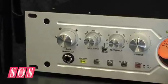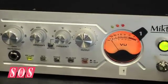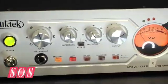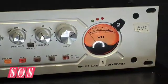We also have what we're calling in the final version a 'smooth switch,' which emulates what happens when people took the module out of the console, versus how it sounded when it lived in the console. In the console it was terminated with a resistor at the patch bay, so it was loaded slightly differently. Pulled out, there's some excitement in the top end when you hit it with a lot of bandwidth. The smooth switch rolls that off and makes it smooth again, like it was in the console — so you have both voices available.